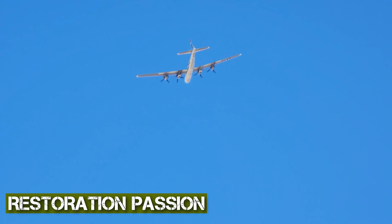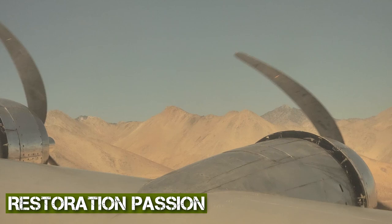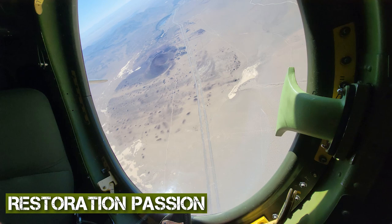It's the same thing with the oil. The oil cooling doors are on the bottom of the airplane. So bring those doors closed a little bit, and then we're going to wait and see how the temperature reacts to it. And as we change direction, when we climb or dive, you can readjust them all over again.